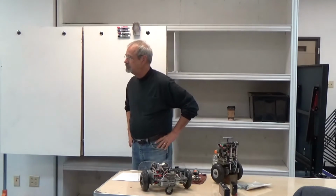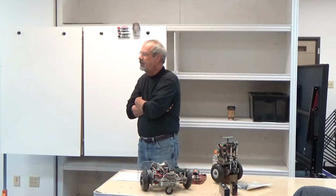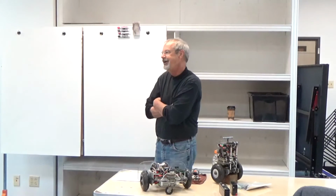Before you get too far, sir. Brushless, people use them for the quadcopters and stuff. If you know, what's the reason we haven't gone all over to brushless? The controllers are a whole lot more complicated. Right. Most of those controllers can't give reverse, which we need for robots, although there are some. I've seen some boat controllers that allow you to give reverse. It's a very different technology.